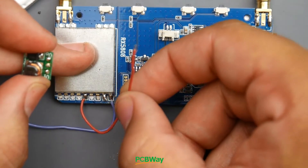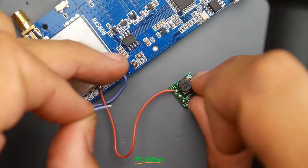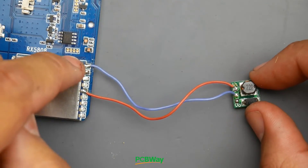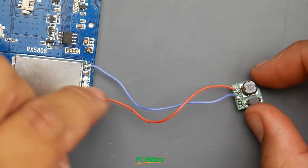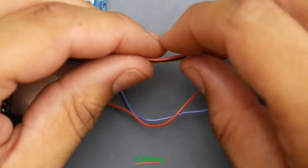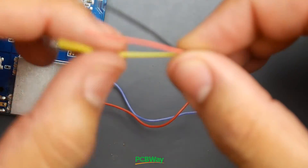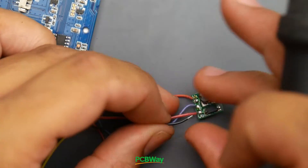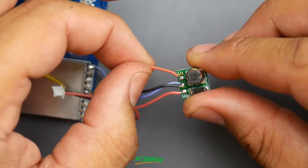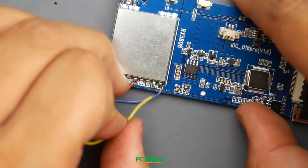So this is going to be our battery voltage — let's just call it 3.3 volts — and that's going to go into the VIN right here. Once that's soldered in, I'm going to get the ground, which is the first one right here, and put it right in the middle. So it should look something like this: the ground goes to the middle, and the fifth pin is going to be the battery voltage or 3.3 volts, which goes to the VI. Now we have the VO left, and the middle pad is also going to be ground. So I'll grab the other connector from the DVR — the male type — red goes to the VO which is voltage out, and the black wire goes right in the middle. Now both grounds are together in the middle. VIN is coming in from here, and VO is going to the DVR. We're left with the yellow cable for the DVR, and that's just going to go right next to the ground — that's going to be the video.